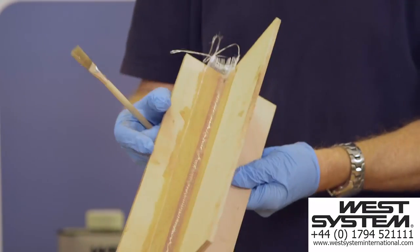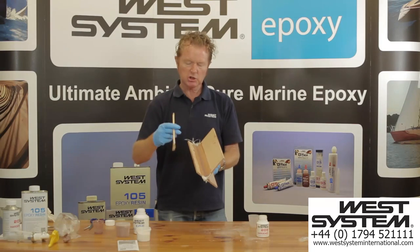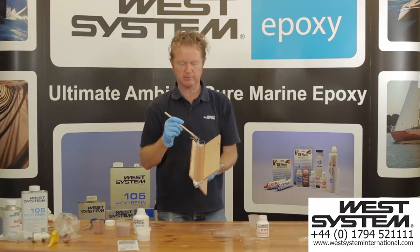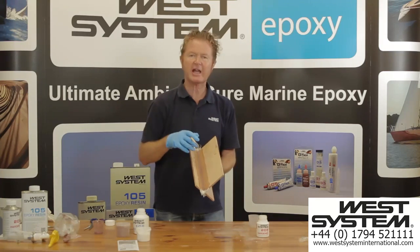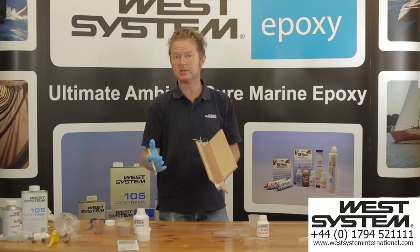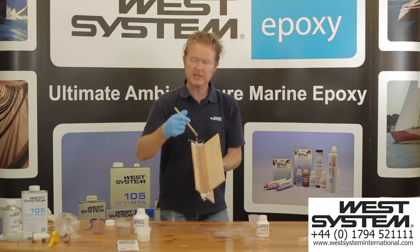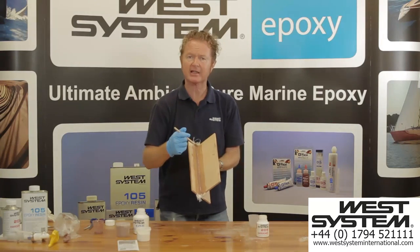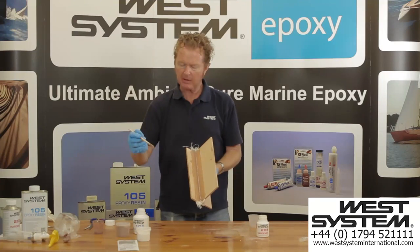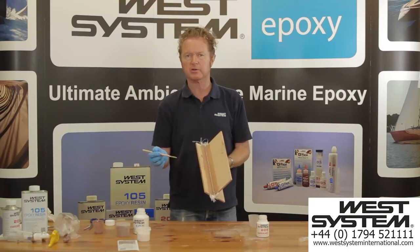Now, if you're going to produce very, very professional results, you would want to sand the surface of this glass fabric. But if you sand it, you'll end up tearing through some of the fibres and hence destroying some of its material properties. What you really would want to do is leave the surface of this to tack slightly, maybe for an hour and a quarter at room temperature, and then apply another coat of West System to fill the weave of the glass cloth.